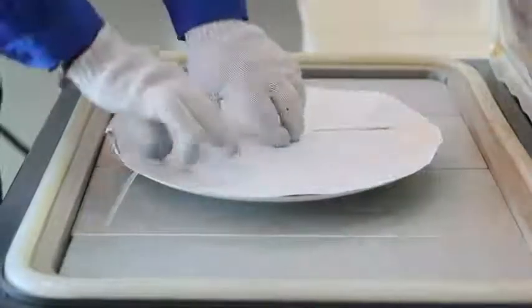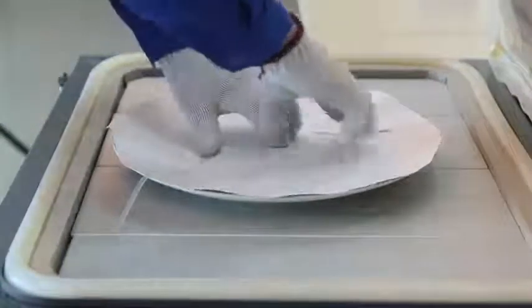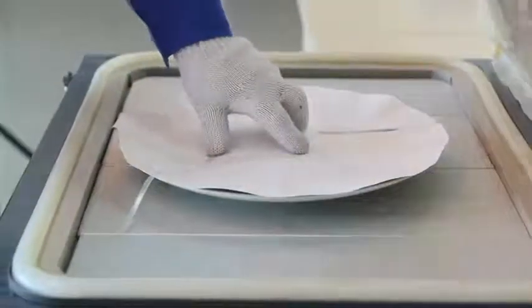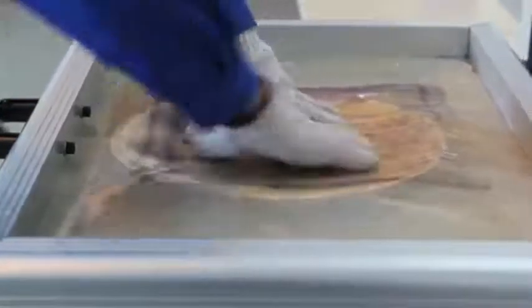Put the plate in the center of the work area. Then put 2 pieces of transparent rubber on the transfer paper. This helps the machine draw the air evenly across the image, so the image is flat and tight across the top of the plate. Turn on the vacuum engine.